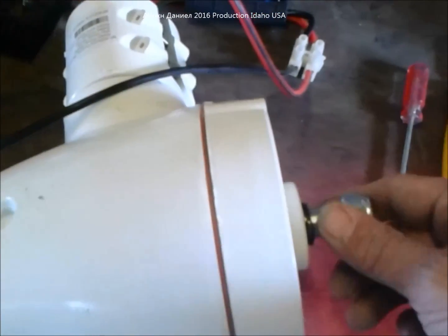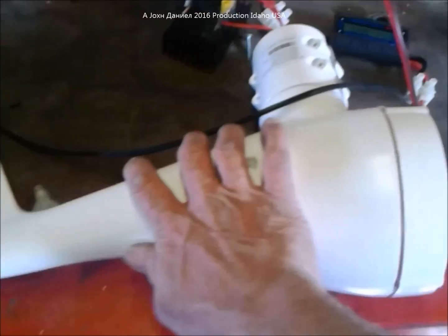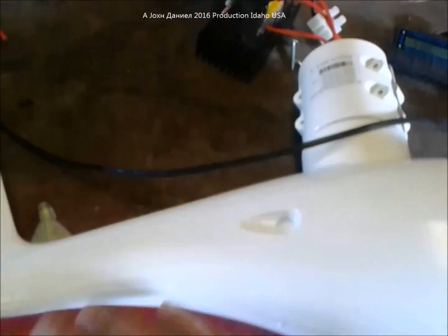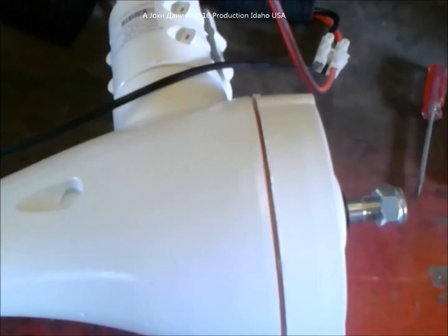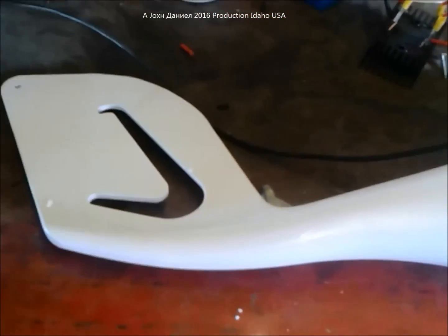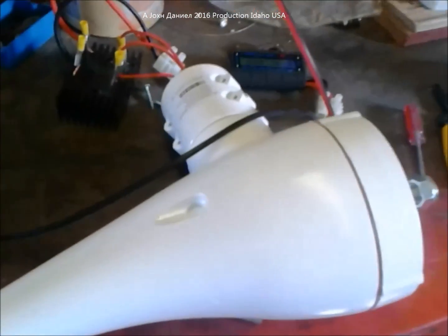In this case, four-foot blades are right for this little unit — look at my hand, it's not huge, and this is just an inch-and-a-half pipe collar. I'd be willing to believe this would put out 200 watts on a regular basis. If I had three of them for 600 bucks putting out 200 watts each, that's twice as much wattage as anything you can buy that looks like an alternator or is called a PMG. Just an update on this little turbine — there you go.